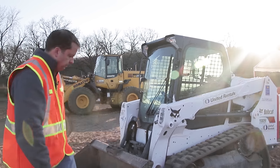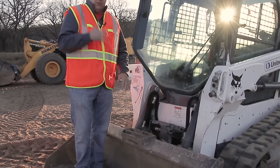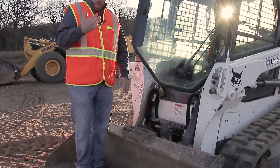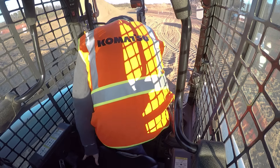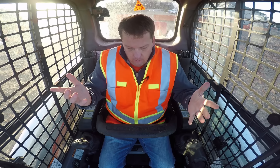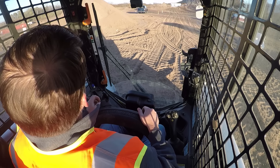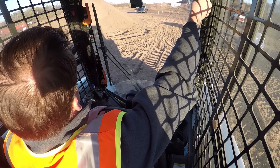I'm going to open these. Skid steers, from a safety perspective, are actually kind of challenging to get in or out. There are some newer machines that now have side entry with a single arm, which are pretty cool. There's a lot to step on here and ways to get your foot wedged in something, so just be really careful. Always three points of contact when you're getting in and out. First thing — seat belt. You kind of wear a skid steer. Most skid steers have this big arm over the top of you that you pull down. On the Bobcat there's a key, and I just wait for the indicator on the left when you're good to start. And we're running.